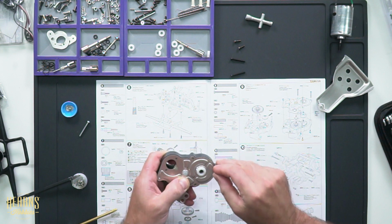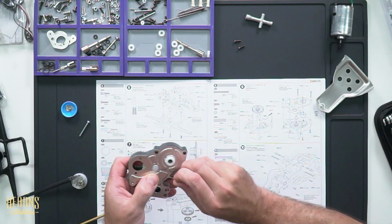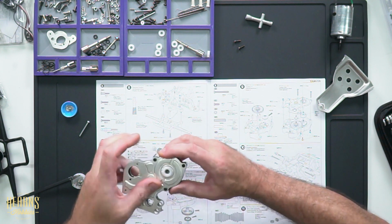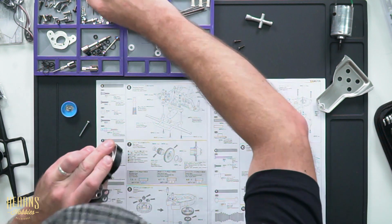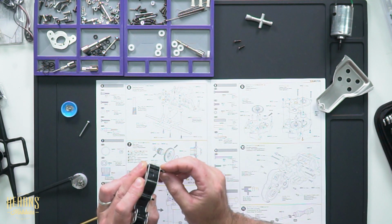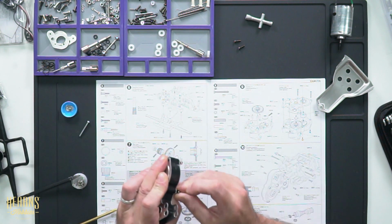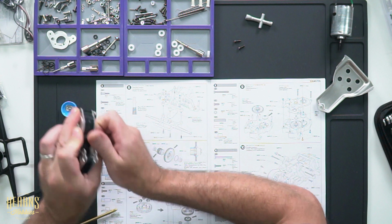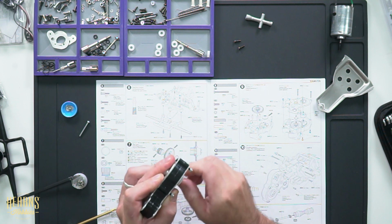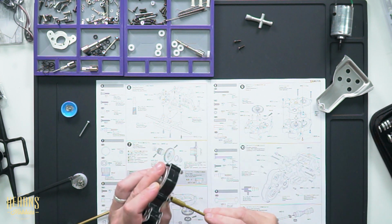Then we can go ahead and put in some of our casing screws. Put these through first, and we'll ensure I get 3 in there at least. That ensures that that is all lined up. Okay, now we'll put some nuts. Nylock nuts for this one. Save it rattling loose. Last one. Okay, go ahead and grab my 5.5mm box wrench for this one.